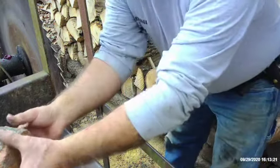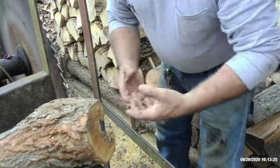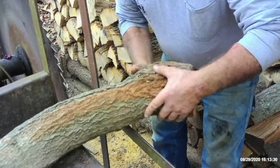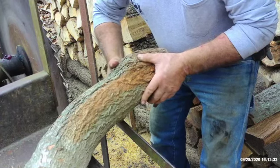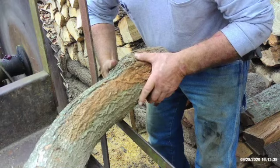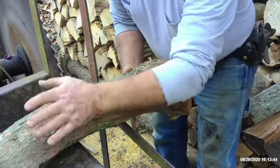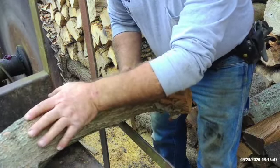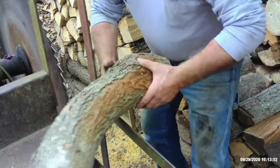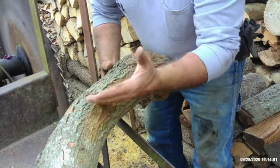One thing that you do not want to do, the off-bearer never puts any undue pressure on the piece of wood. Once again, remember that plane. If the off-bearer here grabs it and starts going, he's going to force that wood crooked as you're entering the blade, because it's an aggressive move. So he has to just lightly hold right here while the operator, the guy that's in control, pushes it through the cut. Then and only then do you grab it. But you can see what happens if you're real aggressive and you jerk it out of his hand. You may even jerk his hand in front of the area that could intersect the blade.